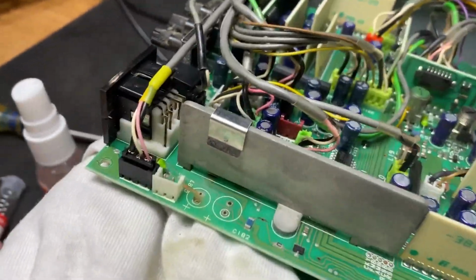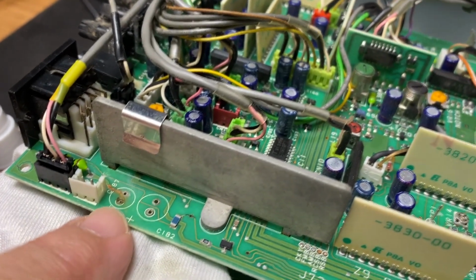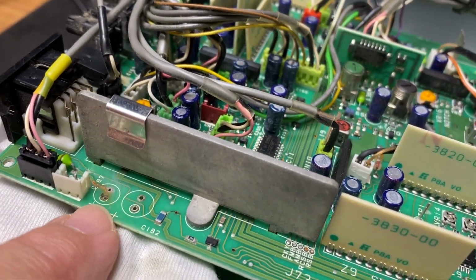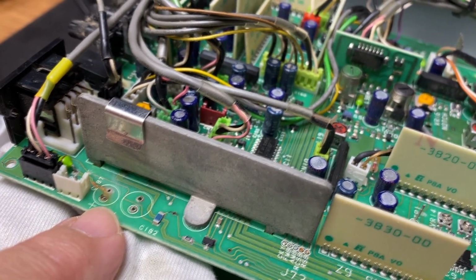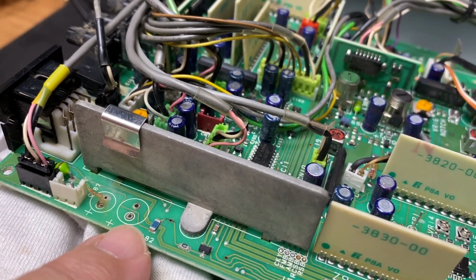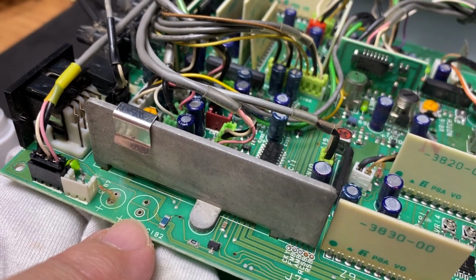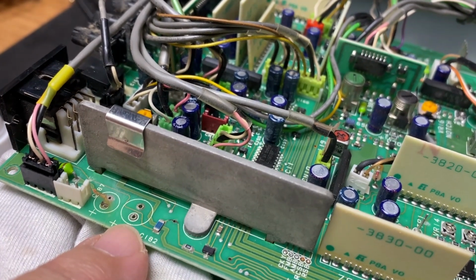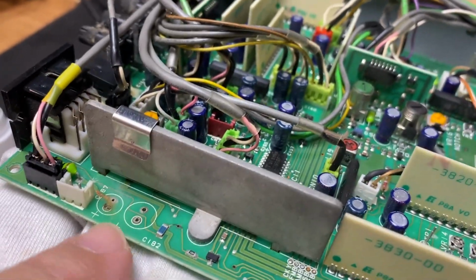So I've got the board cleared up and cleaned up. These are double-sided, where I've got to get solder onto this top side as well, as you guys know. And then here's the one that was just kind of off in the reading, but it was a good cap. But I figure while I'm here, let's just get them done, pull them out. Plus I had to inspect anyway.